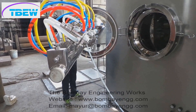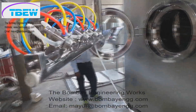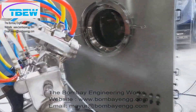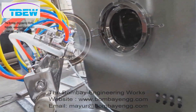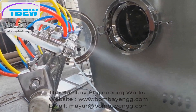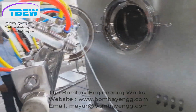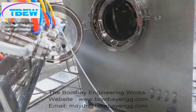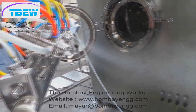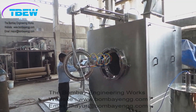The spray guns can be rotated 180 degrees for maintenance. Right now water is being sprayed as a demonstration. A separate flow control valve is provided for each spray gun so you can control the spraying from each gun independently. Depending on the batch size, you can use fewer guns — for a small batch many people use only two guns — and you can stop flow from any gun as needed.